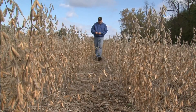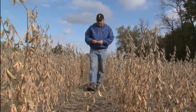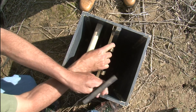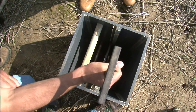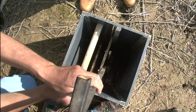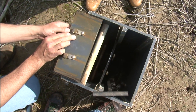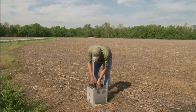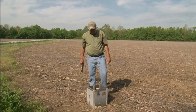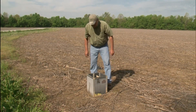Producer Mark Wessel uses the practice on 100 acres of his farm in southeast Missouri. Two weeks before we plant, we usually go to each water control structure and start pulling the stop logs out to let water drain out of the field. Depending on the surface water and your rainfall determines how many logs I pull out of the box. The water control structure boxes are very easy to work with — it takes one minute at each box to raise or lower your water table.